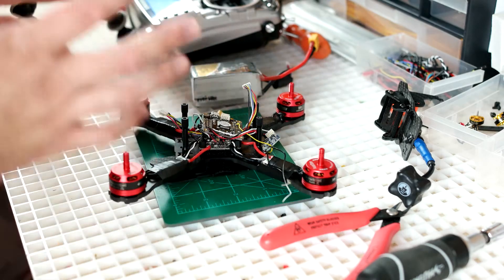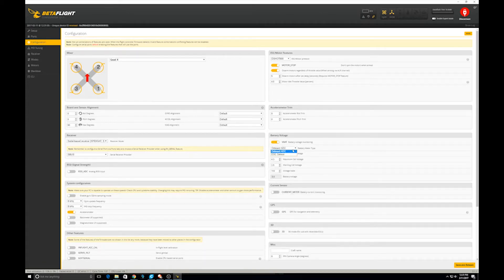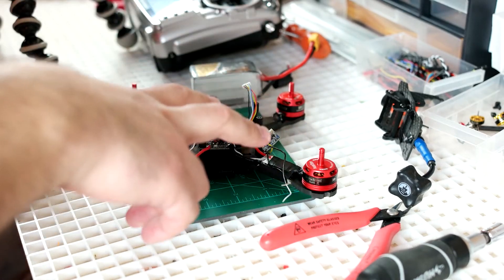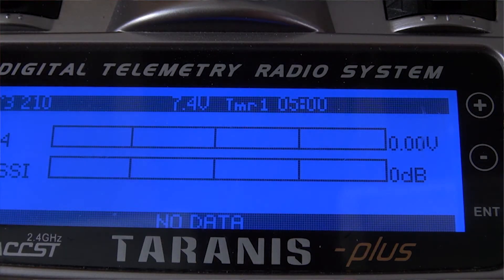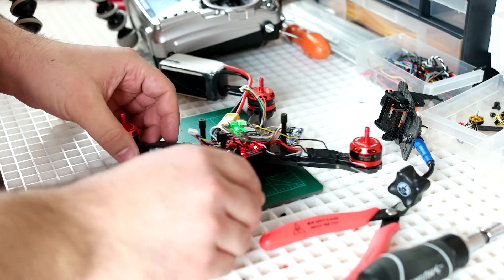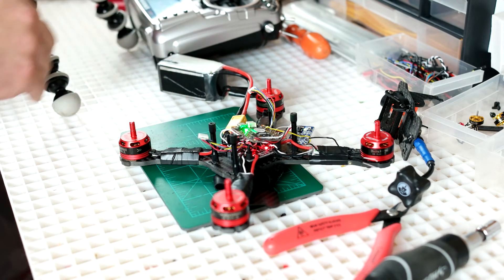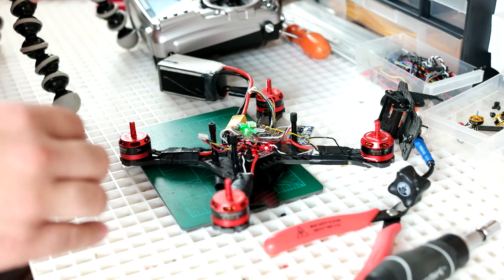Alright guys, good news. I went and checked this out on the computer and what I found out is I actually didn't have VBAT monitoring turned on on the flight controller. Without VBAT monitoring on the flight controller, there's no way to send battery voltage, which is what we were looking for on telemetry. So I went into Betaflight, I enabled VBAT, I rebooted, and that should actually solve our problem — I think everything was soldered correctly. So now let's try this test again. I'm going to switch over to the telemetry screen I've set up, which is showing RSSI and voltage per cell. Now if I fire this up, we can see that we have a green — we've connected — and you can see we now have telemetry. This battery was not brand new so the voltage is at 3.85, but everything's working. We're getting telemetry on our Revo. That simple mod solved our problem — we are now good to go.